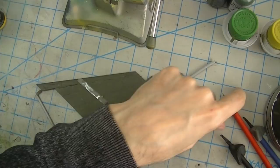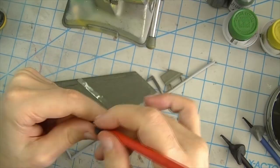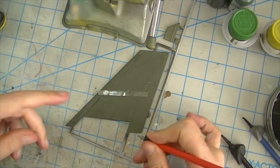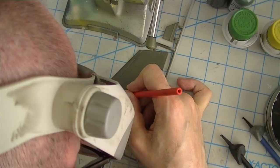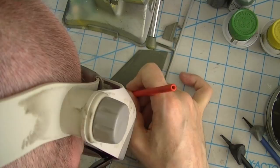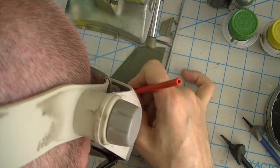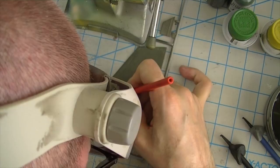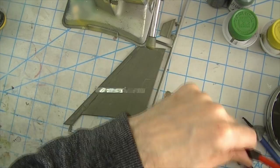Again, you can see nice little curlicue of plastic right there. Now, let's try out this other one. This is just a straight point. And so it's not going to cut. It's going to gouge. And the only time I use one like this is when I'm using a template and I'm scribing a round hole or a panel outline, for example. But since I've got this here, we'll just check it out. Not too bad when you drag it along there. I mean, it chatters as you would expect because, again, it's gouging and not cutting. And when I peel this Dymo off of here, you'll see the difference in the type of line that it creates, because it'll have little ridges on each side of it.